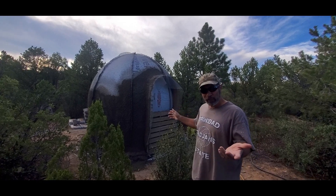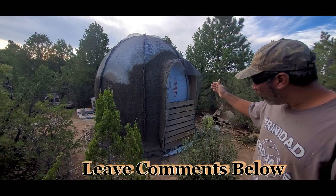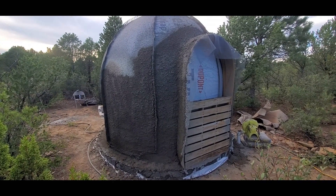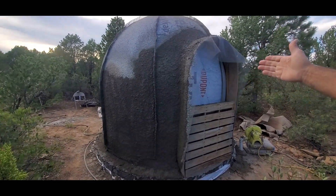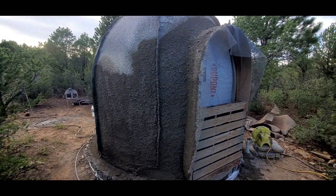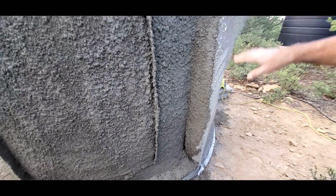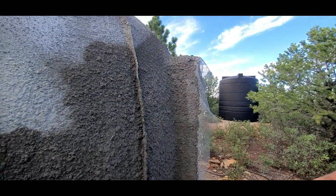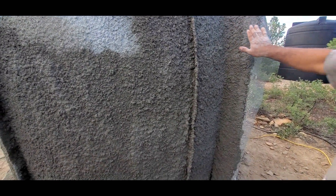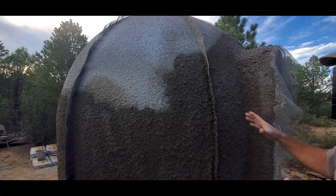On this side, I'm demonstrating the form to make this arch — you can't get any simpler. All I did was use a pallet and a few pieces of masonite board that I cut into thin strips. These are the same masonite boards I used for the foundation ring beam — I removed that wood and recycled it to make this archway. I don't have to bend any bars to make the shape. Once it cures, I'll put another mesh layer on tomorrow and it'll all be blended into a monolithic cement dome.